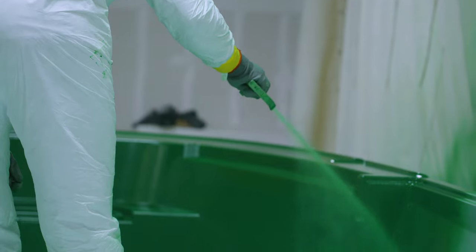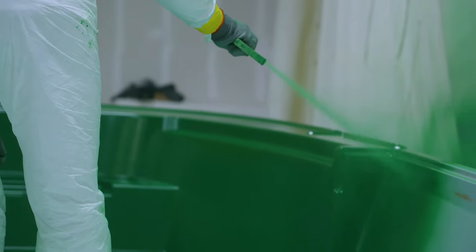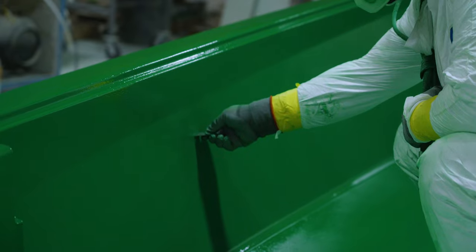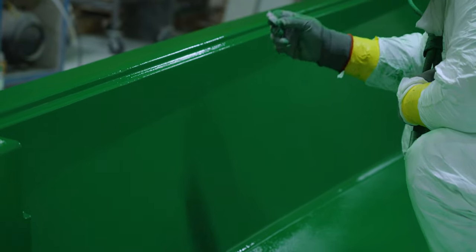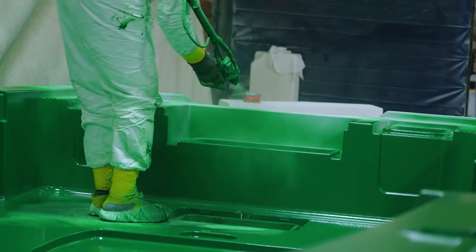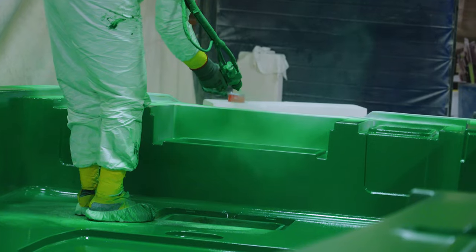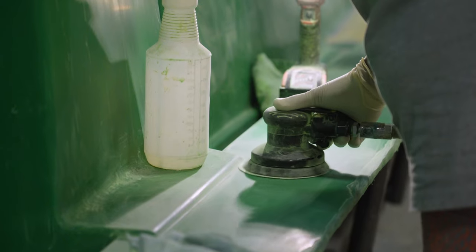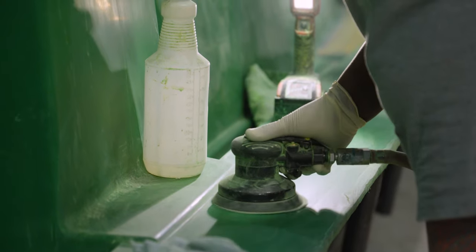Tooling gel is specially formulated to excel in three areas. Dimensional stability, meaning that it won't expand or contract. Hardness, this is necessary to withstand the hundreds of pulls the tool will be exposed to over the years. And its ability to be polished. As normal wear and tear takes place, these molds will be wet sanded and buffed many times to restore the flawless surface.